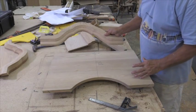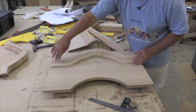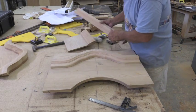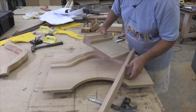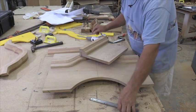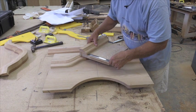We're ready to take this molding and set it on our crown plate here. We've got to get this on here perfectly parallel — it can't be sitting like that, it's got to be perfectly parallel. The first thing you do, remember that molding we got for the sides here? You're going to attach that molding to your side pieces right here. I'd put them up about 8 inches.